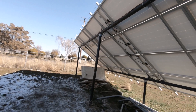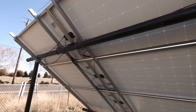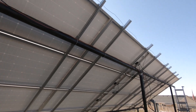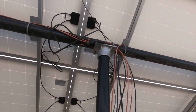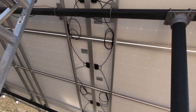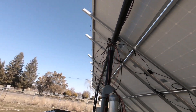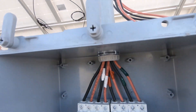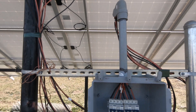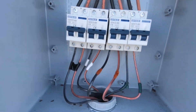Down there you can see there's white tape on those, black tape on those ones up top, these connectors have red tape, and these ones have green tape. So: black, white, red, and green — that's the order of each series up on the array, and the wires are marked the same way going inside.